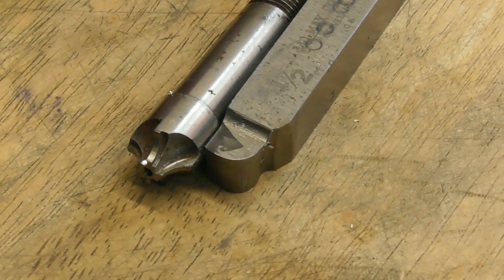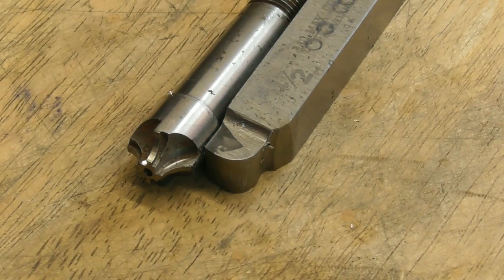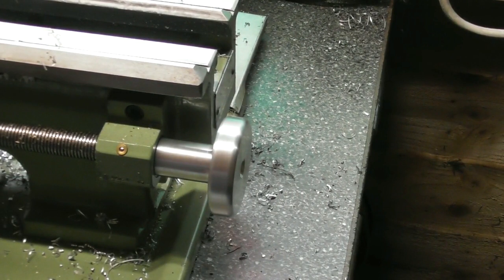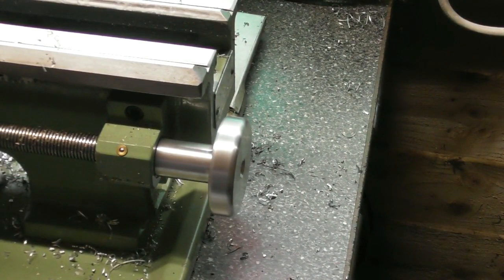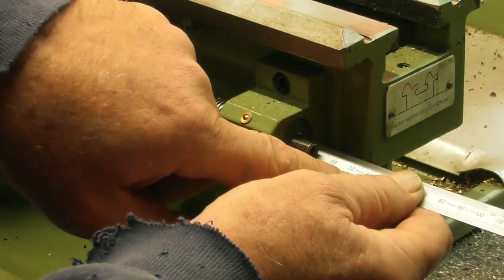There are 101 ways to put a radius on something. These radius cutting tools are more conventional, though on a small lathe a 6mm radius is probably pushing it as far as chatter goes — but it did the job. I've just tried the hand wheel on there and it seems to fit and look like it should. We still need to make the handle, but that's for part two. Thanks for watching guys, thanks for subscribing and I'll see you in tomorrow's part two.